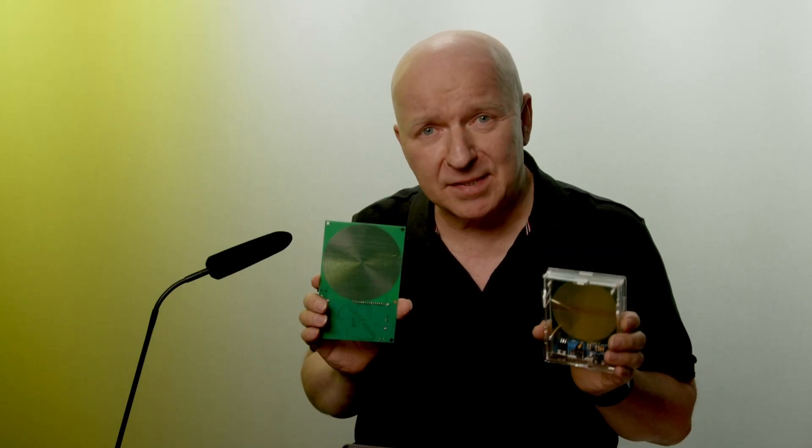I tested these devices out — you might know them — and I found many disadvantages. Some produce just a square wave, and others produce a sine wave, but it's digitally made. They have a PWM synthesizer built in, and they build the shape from just mathematical lines. The power is nearly nothing, and they produce more electric noise than the frequency itself.